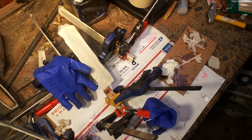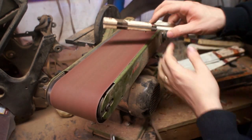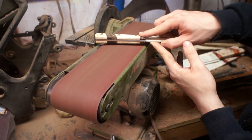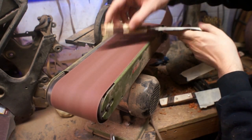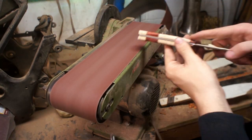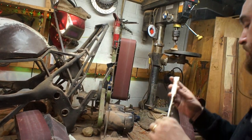With all of them I made sure to get as much of the epoxy off beforehand as possible before it cured. Here I'm setting up to grind the pins flush with the handle. I like to let this stuff sit overnight because you build up a lot of heat even if you're careful to switch around. The five-minute epoxy will feel like it's set but it's not quite fully cured — you can blow it out and make the pin start moving if you get too much heat in there, so better to let it sit for a while.